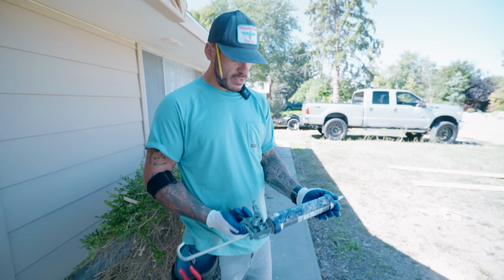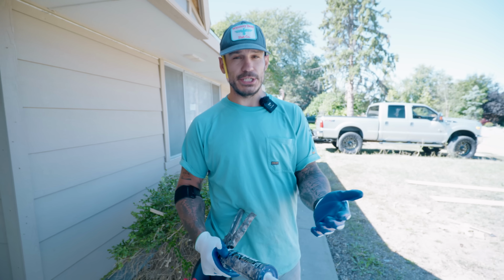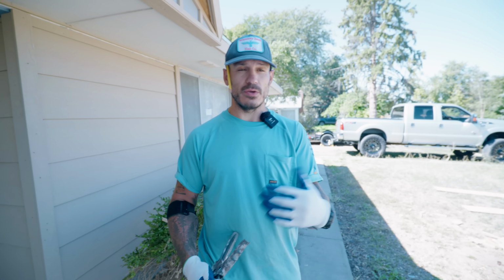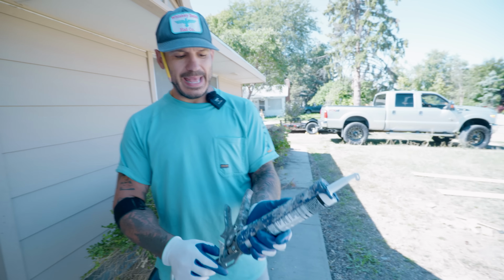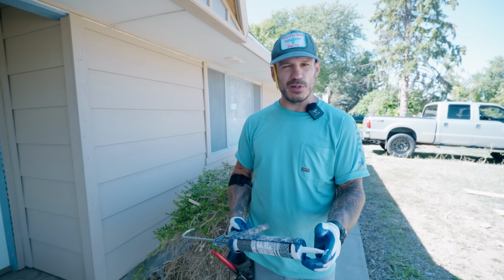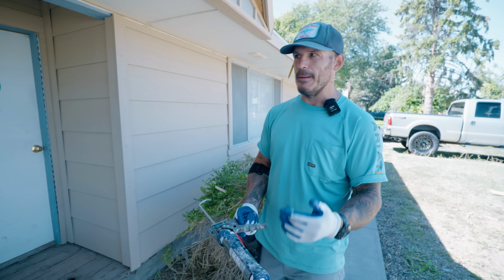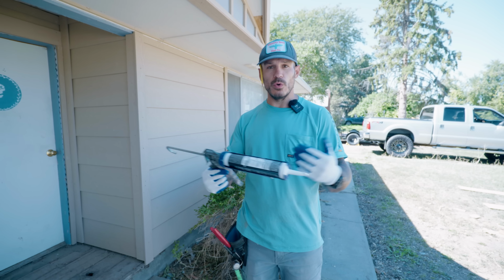There's a bunch of different stuff you can use, but from my understanding, there's exterior stuff that cures in 20 minutes so you could start painting, and that stuff doesn't have the best elasticity and movement that we need for the outdoors. And then there's stuff like this, like Dynaflex, not a sponsor of this video, but it is one of the most extreme ones that I have found so far. It cures a little bit longer, it takes like an hour before you can paint, but when it does cure, it has far more flexibility and elasticity for the wood movement to take place.